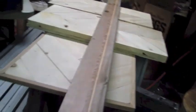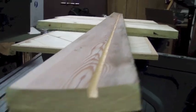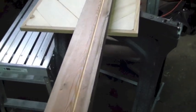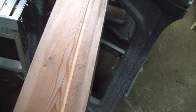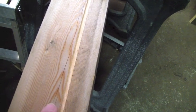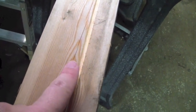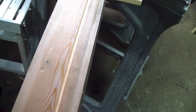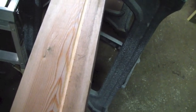Basically what I'm doing is trying to recreate a dado myself, which is also not easy on a board that's warped. This board right here is cupped quite a bit — it rotates back and forth. What I'm doing is I set my table saw blade to run a little over a quarter inch deep and I've cut two grooves in this board so far. Then I'm going to figure out exactly how high I want this, inching down slightly. I'm going for a 1/16th proud.